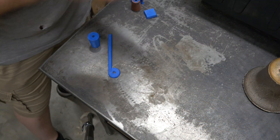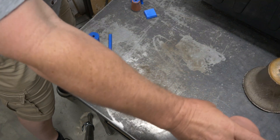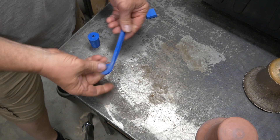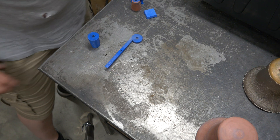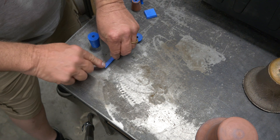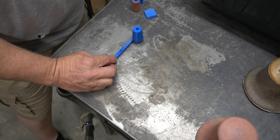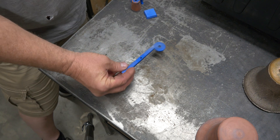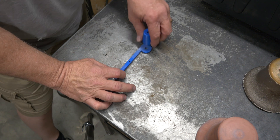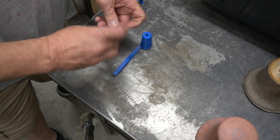Let me show you real quick how we're going to set this thing up and talk about a couple of things I've done a little differently here. First off, I'm going to have my runner get down in the drag - it'll be in there sort of like this. The sprue, which is inside, will mount here, and then I will have a surge trap up on it. This will be up into the cope, so basically the runner is in the drag and everything else is going to be up in the cope.